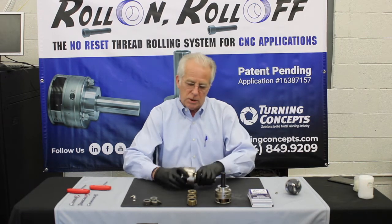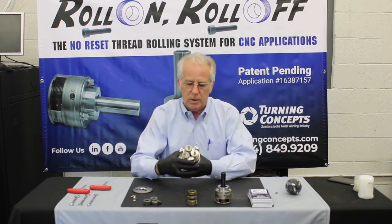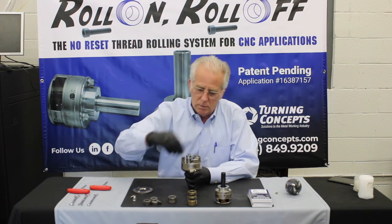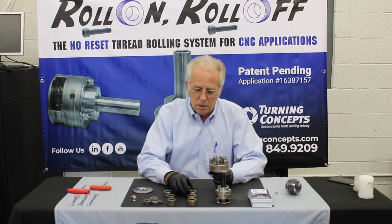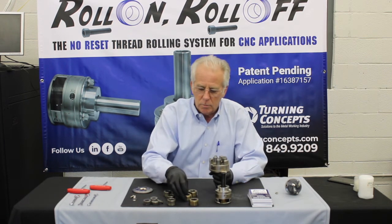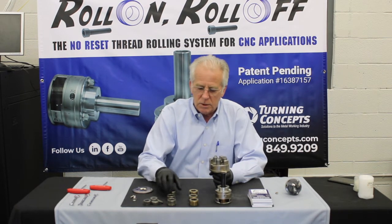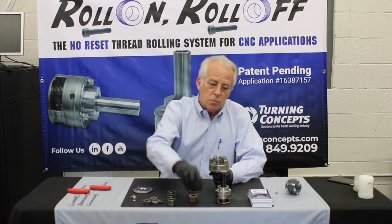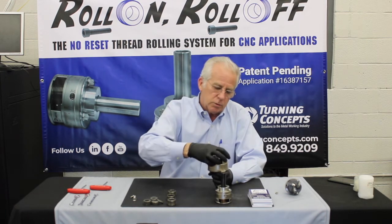And you get to use rolls on both sides. Here's an F2 number two size set up with a half thirteen or five eighths. You have three sets of rolls. You take them out and you'll see that they're number one, two, three. Your second side of rolls — notice that number one becomes A, number two becomes C, and number three becomes B. The reason is the majority of the load for the material displacement occurs on roll number B. So you want to load them clockwise in sequence, and then you put your faceplate on.